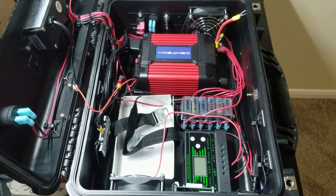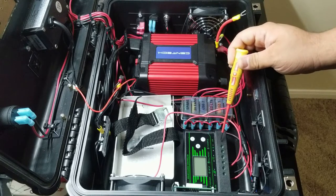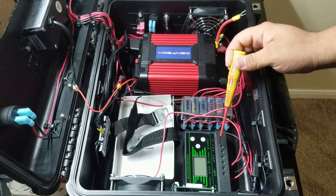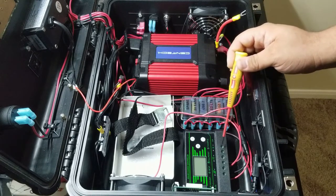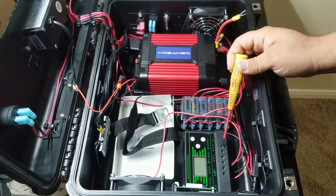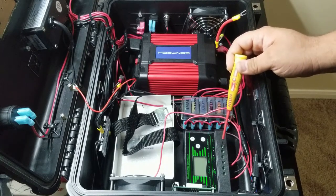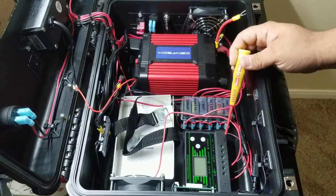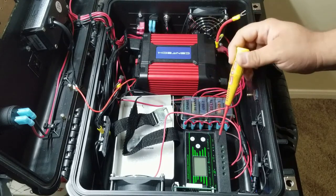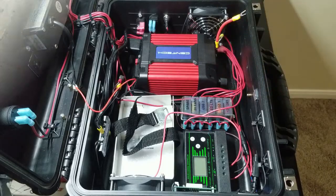Next, we'll talk about the solar charge controller. The solar charge controller, there's already a link in the description for the first video. I'll try to get it on this video as well. This charge controller came from Amazon. I believe it was $10.99. It is a 20 amp solar charge controller, so it can take in about a 100 watt solar panel and charge the battery. I've already tested it, and we're going to show the test video right now.